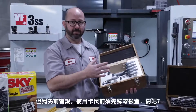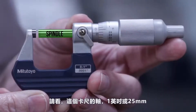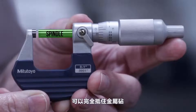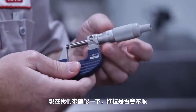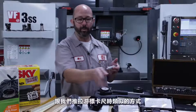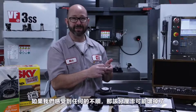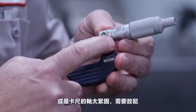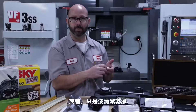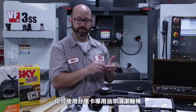Look at the spindle — on these one-inch or 25-millimeter mics, it can close all the way against the mic anvil to zero. As I do that, it's a good time to check for any drag, similar to how we checked the calipers. If we feel drag when closing, the mics might have been damaged and need repair, or the spindle clamp may be slightly tightened and needs to be released or cleaned with some micrometer oil.